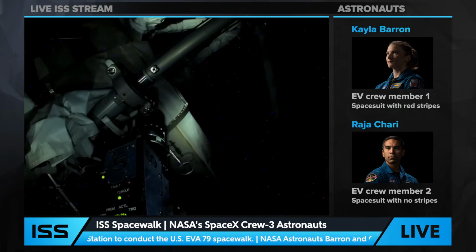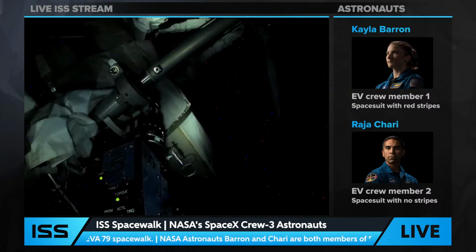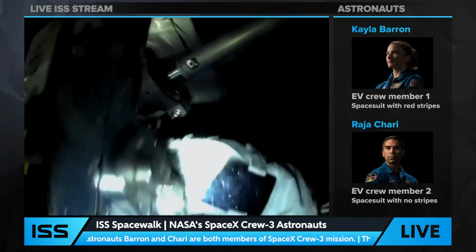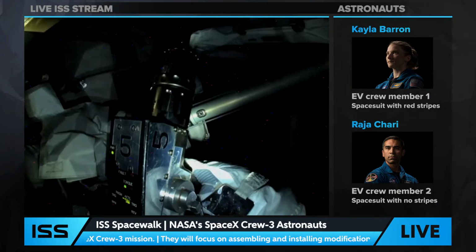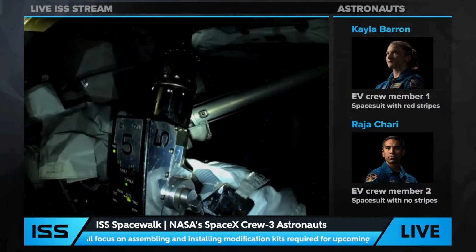And which bolt? That was M29. Copy. On M29, we got a green light. You said you also saw low torque? Yeah, there was a low torque message, but then it cleared and the green light came on. And the actual torque is 21.6. Programmed is 25.5. Okay, copy. You can move on to M30.